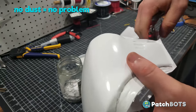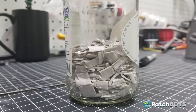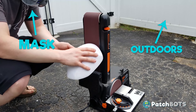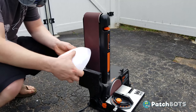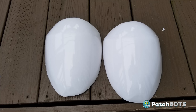For a couple of the smaller parts I did the trimming with a small pair of snippers indoors, in order to obtain a cache of perfectly uniform ABS chips - these will come in handy later in the build. After the initial trimming, I did a cursory sanding of all the really rough edges with a belt sander, just getting rid of the super jaggies left by my trimmers and the Dremeling. From here on out, each of these pieces is going to require its own unique attention.